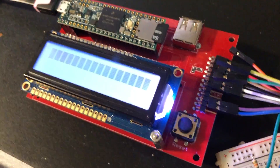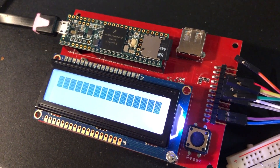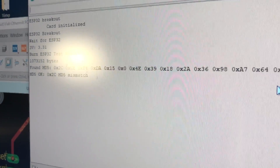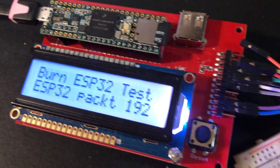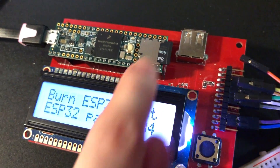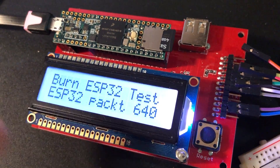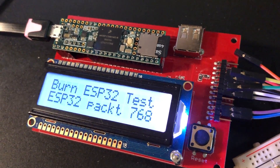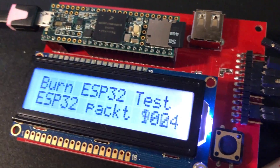This is a project I've been working on this evening. It's an ESP32 tester that runs on a Teensy. It actually programs the ESP32 directly over the UART using the built-in bootloader ROM, and the binary file is stored on an SD card. I'm experimenting with this different way of programming and testing ESP32s without using a Raspberry Pi or a computer — just a Teensy 3.6.